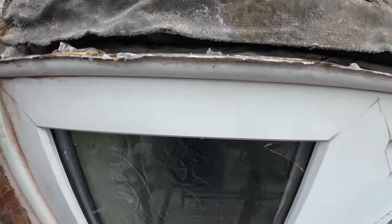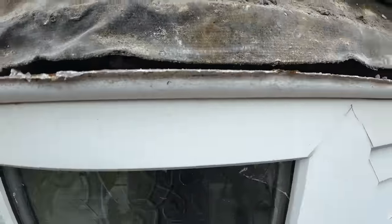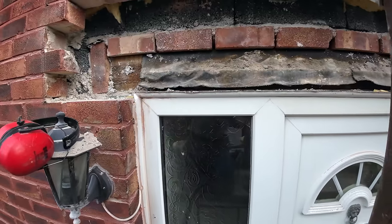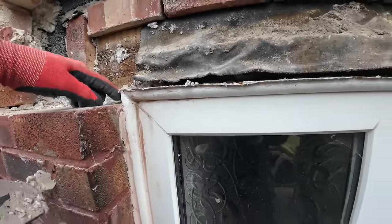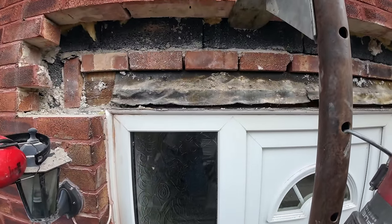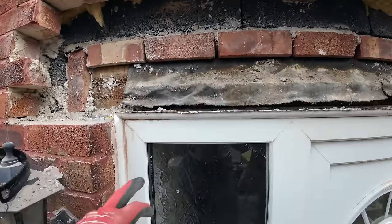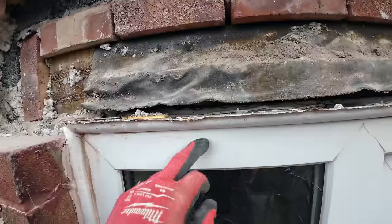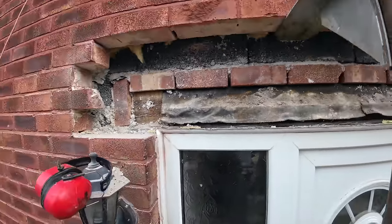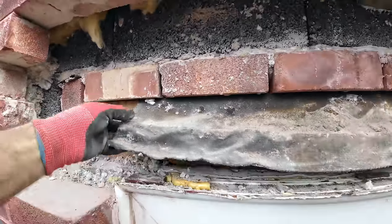We're going to have to chop the top of this door off, I'm guessing. It looks like it's a bit higher than the brickwork. We'll have to see, but our lintel might go back. Anyway, we'll see. We can hack away at the door anyway because it's coming out. Was the door coming out too? Yeah. So we can just cut a notch into the frame so we can get the lintel back. Got a nice timber frame to put our nails in so the lintel doesn't fall back.